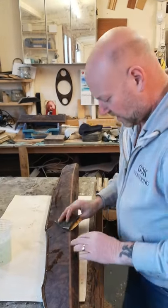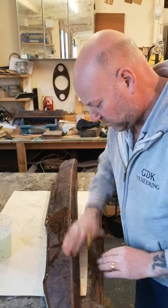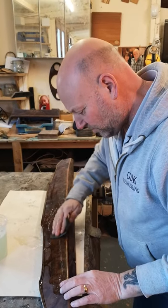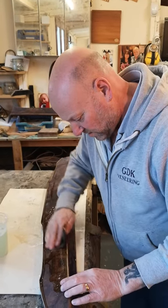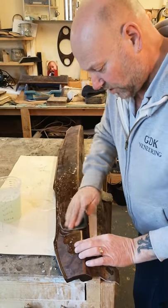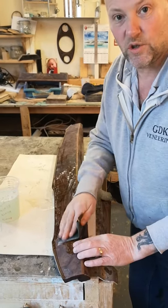What I'm going to do is start doing this in circles. Don't do it like that — if you go around in little circles you can keep track of where you've got up to. I am applying a bit of pressure onto this. What this does is it takes out any swirls that the sanding machine will put into the lacquer.